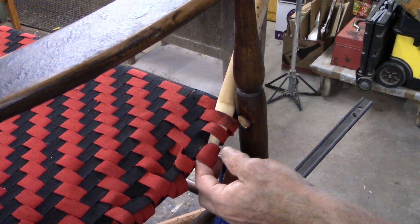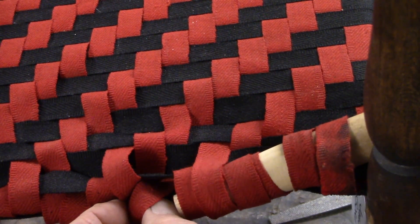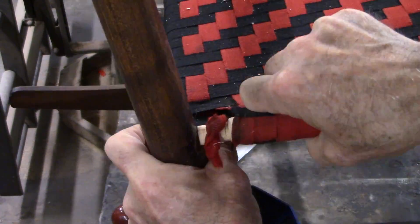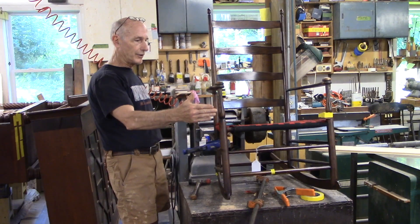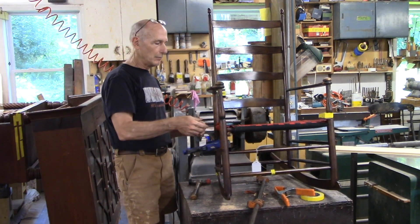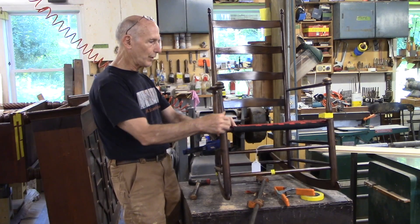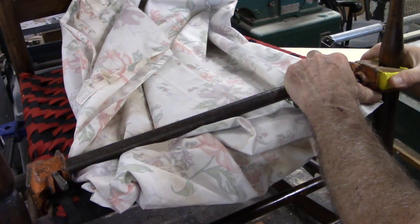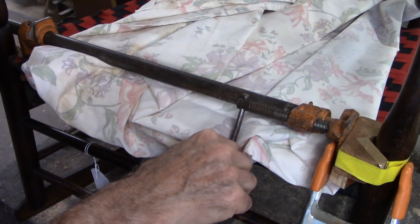Now I've got to see if I can feed this through the webbing. I'm having a heck of a time getting this piece where I want it to be. We spread the chair this way and that worked great — I've got the spindle in and out — but once I've threaded it through the webbing, I'm having a really hard time pulling it across the width of the chair. I've rigged up another type of clamp: a small pony clamp with the tail and head reversed to make it into a spreader clamp too. I've got to see if I can get the clamp on the spindle and push it over to where I need it to be.